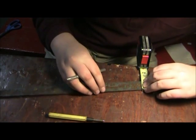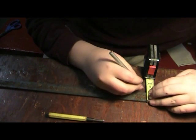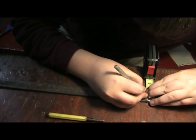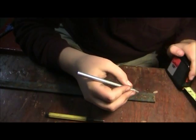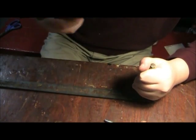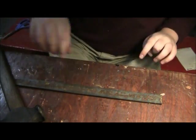First of all, I'm going to measure my distance — the width of the piece of material, or whichever way I'm drilling it — then find half of it since I want to put a hole in the middle. I'm going to mark it with my scribe. Got half. Then get my center punch and put it where I want on my scribe line. Now I have a nice little mark.